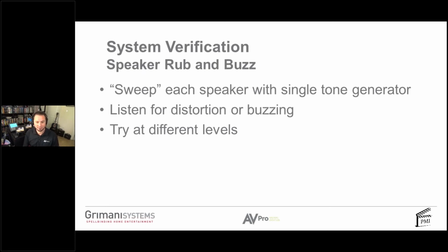So yeah, let's say you don't do this, and you go through the whole process, and you do your EQ. You spend 2 days tuning the system, only to find out that the center speaker has a cabinet rattle at 200 hertz because it was sent over and dropped by our friends in the shipping business. Like trying to calibrate a broken TV. I mean, it's the same thing, right? Right. And so start over. Just wasted a bunch of everybody's time. And I'm not talking in theory. I'm talking from experience.